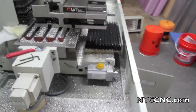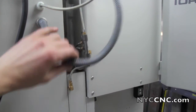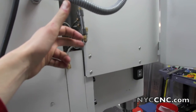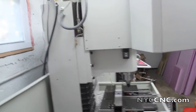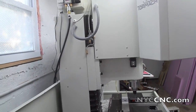My next step is — I've reassembled the main feed line right here — and what I'm going to do is take off each of the four manifold extensions one at a time, pull my valve, and see how much oil flows through. I'll waste a little bit of way oil this way, but it's not expensive, you get plenty of it, and I think it's the most reliable way to understand what's going on.